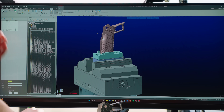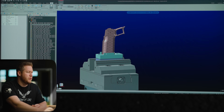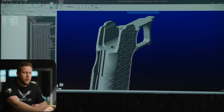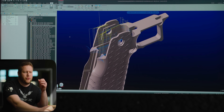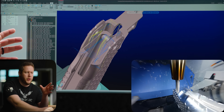So we're going to be left with this, standing up in our vise. Now if we take a look at this stock model, this is basically what we've got to deal with. We've got the bulk of the material out, but we still need to get rid of the rest of it. The first thing I'm going to do is come in with a 3/8 end mill and re-rough that material away.